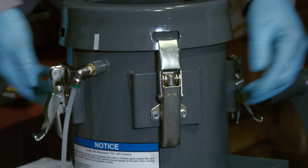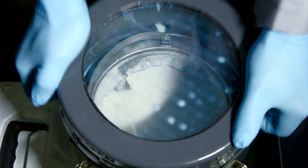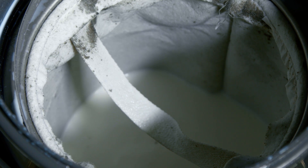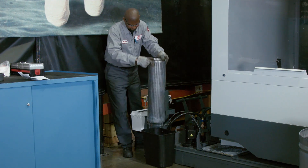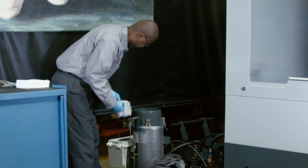Next, open the four latches that secure the lid to the tank and remove the lid. Orville waits for the tank to drain — this usually takes about five minutes. He then removes the metal strainer and the filter bag assembly, placing the strainer into a plastic waste can while he removes the filter bag.